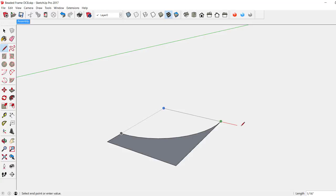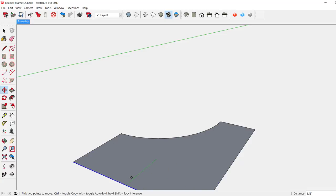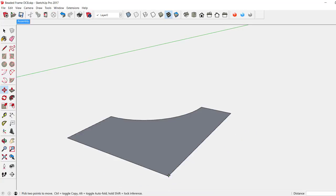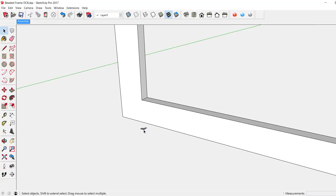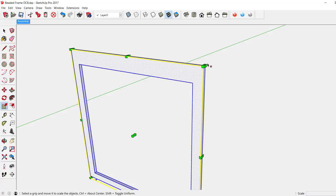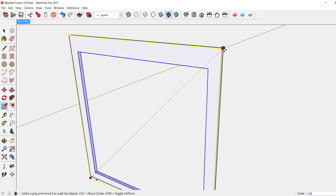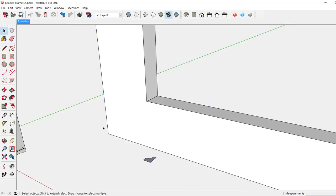and I want to extend the size of this cutter. That'll make it easier to clean up, and I'll increase the size by 1/8 of an inch on this part, and also pull this out 1/8 of an inch so the cutter protrudes out through the front surface of that frame. Now to run a follow me, but first, this is a small bead, and I'm sure this will result in very small facets that SketchUp won't handle that small. So I'm scaling up by a factor of 10.